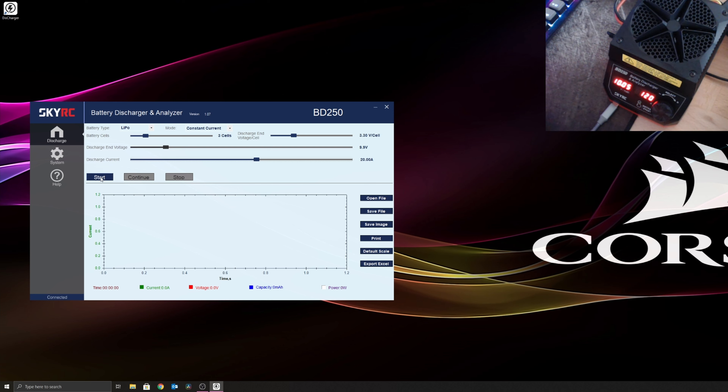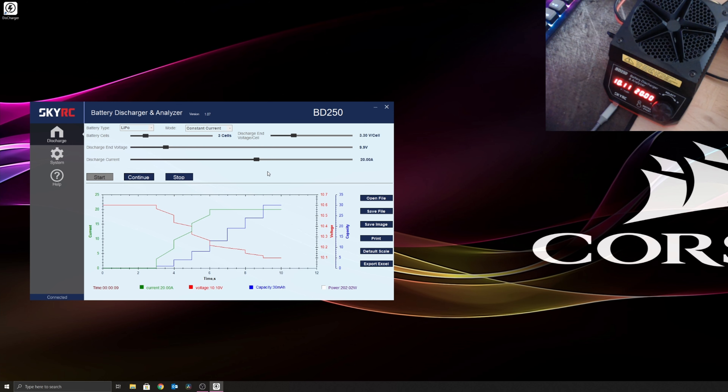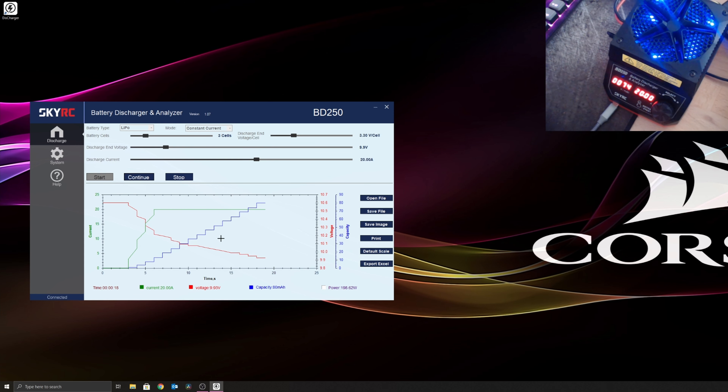This battery is only on storage charge so it shouldn't take long to drain at 20 amps. I wouldn't leave this unattended because if your battery or cable starts overheating you want to be there to see it and make sure it's not going to catch fire. As it reads the amount of current it's going up, and it's basically drained it to 9.9 volt — so that one didn't have much charge in it at all. It tells you it's done. The amps — the green line — shot up and managed to get to 20. The voltage came from 10.6 volt and drained down to 9.9, and you can see how sharply it fell.